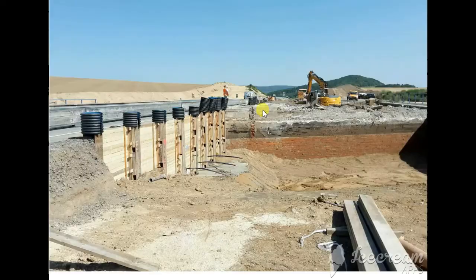This is the joint between the two bridges — we also have to cut the water stop. You see there is a water stop between the two parts of the bridge; it's a kind of rubber that will not be affected when we break the bridge. So first we excavate the area before and after the bridge and make it clean, then we will be able to demolish the bridge — half of the bridge.